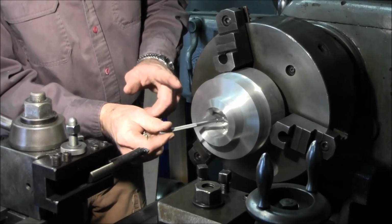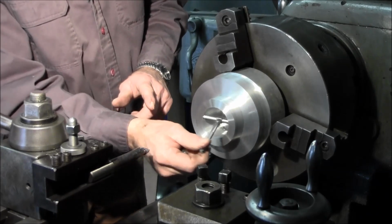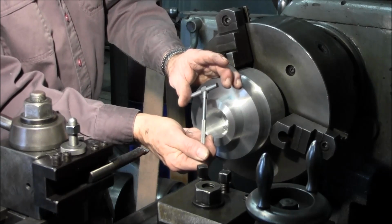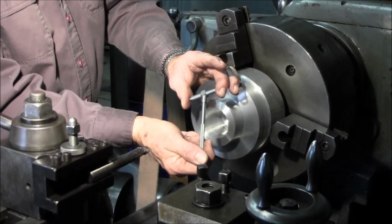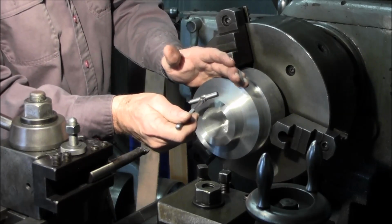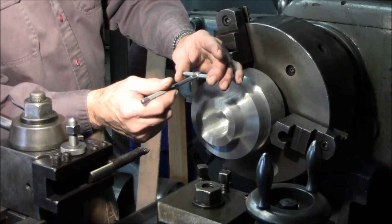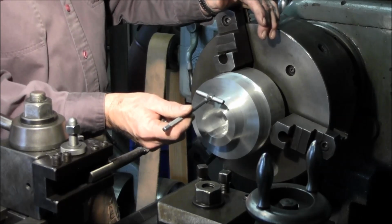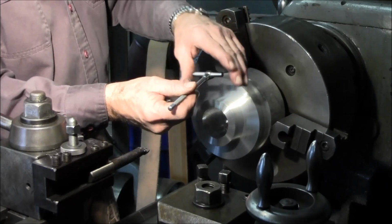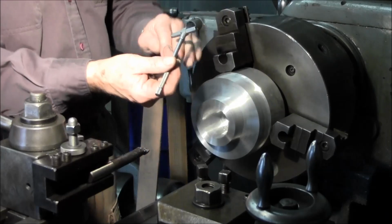And then hold it in the bore and push it in one direction straight across. Those 2 will be squeezed in and will remain at the smallest point of the pass through the bore. As pressure's being pushed on these 2 points right here, they're trying to find the largest opening to pass through. So they normally will find center on their own, and that's how snap gauges actually work.